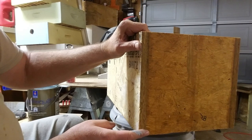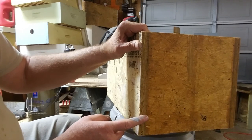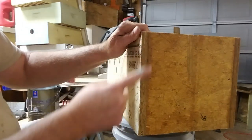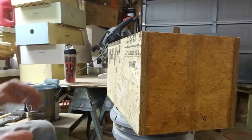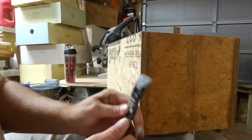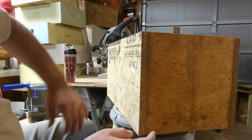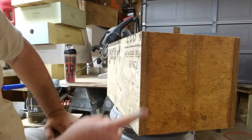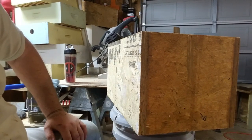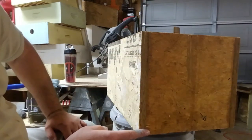The other thing I do is mix Titebond 3 — I'll put a little bit of water in it, maybe a cup of glue and an eighth to a quarter cup of water to dilute it down. I've got a little paintbrush and I'll cut the bristles so they're maybe three-quarters of an inch long. I'll turn it up on its end and run a bead of that diluted glue and rub it into the corners, because I do butt joints. I'll let that dry — it's about 75-80 degrees in here with the wood heater — then come back over it with regular undiluted glue, because the ends are bad to separate.